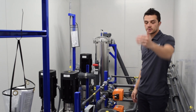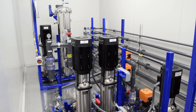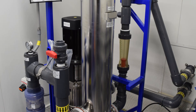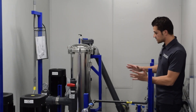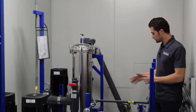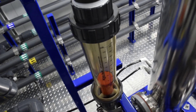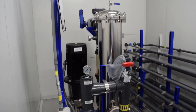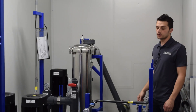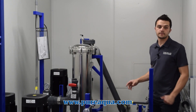We're utilizing the same setup as before — two alternating CRN pumps manufactured by Grundfos, inlet and outlet isolation valves, process flow meter and gauges. On the back side of the container, we have a flush skid utilized for both flush and CIP operations. Due to space constraints, this skid is in the 40-foot container. It's a standard setup with a stainless steel 316 pump, gauges, a flow meter, and a 5-micron cartridge filter. About 90% of the time it will be used for the permeate water flush discussed in the SWRO container, and the other 10% as a CIP skid for the SWRO and TWRO systems. We've designed for both cases to reduce cost so the customer can use one skid for both setups.